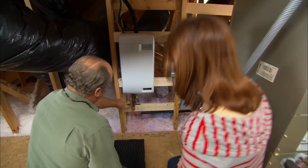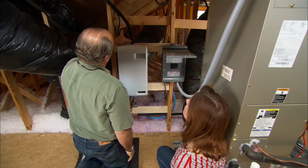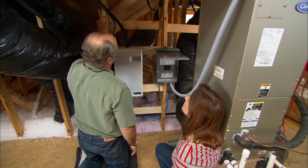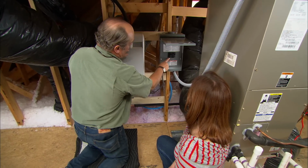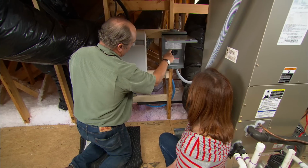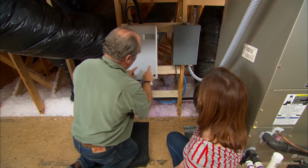All right, Cindy, we've made our final connections. Okay. Here's cold water into the humidifier. Here's the drain. Leaving the humidifier, we've got this insulated hose with steam going to the wand. We also brought a licensed electrician in. He added a separate circuit right here, and that gives us 220 volts from this panel over to the unit. And we've also got a couple of control wires into the back.